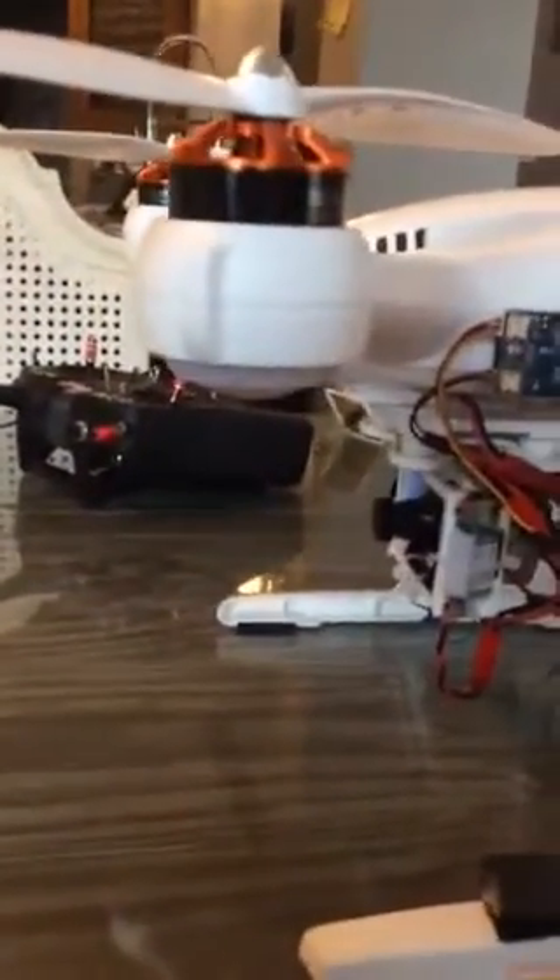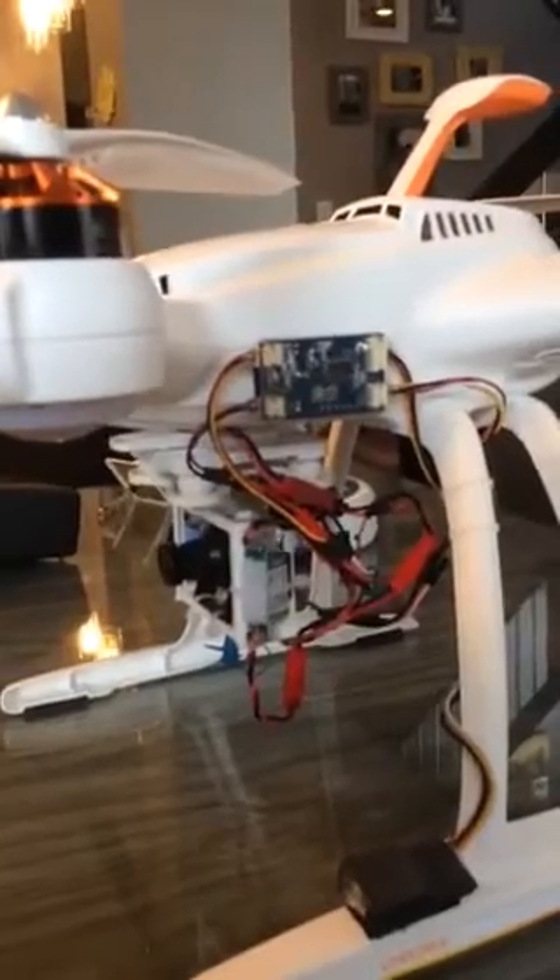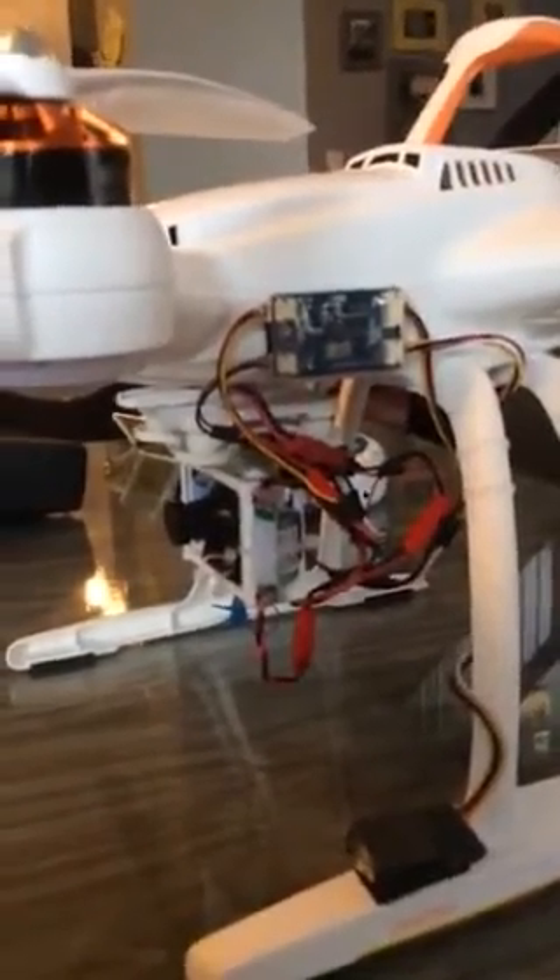On the leg here is the GPS antenna for the Supo. The other mod I did, which was actually fairly important, was I ran the stock Spektrum receiver antenna out of a hole there — it was originally inside running parallel with and right up against the main board. I was only getting about 2,200 to 2,400 feet before I would get the fail-safe tripping. It wouldn't stay on permanently but it would flip, indicating it's losing enough packets to be concerned.